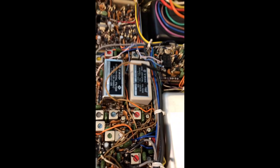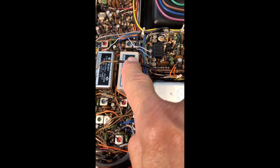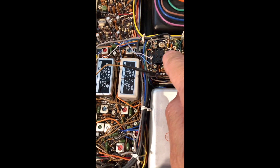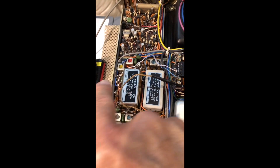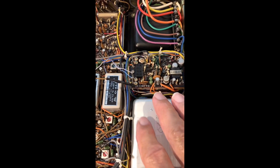Not much more to it. Now, to reverse this, I would have to take this out of here, put it back in here, take these wires off, and connect the brown wire to the CW post. So I'm going to make a note and place it on here.